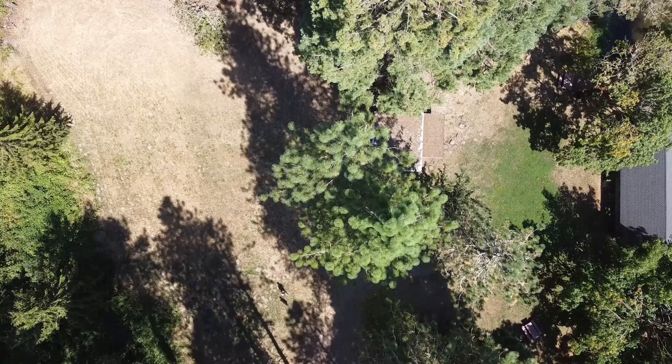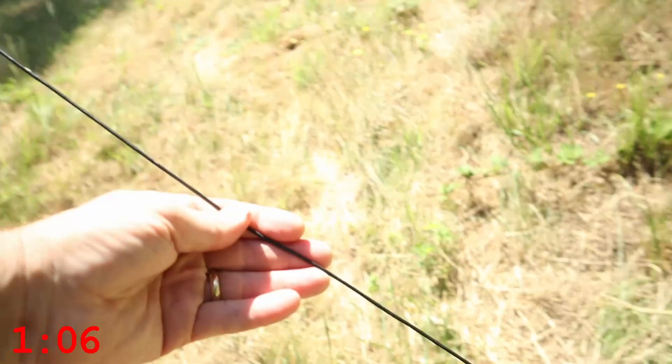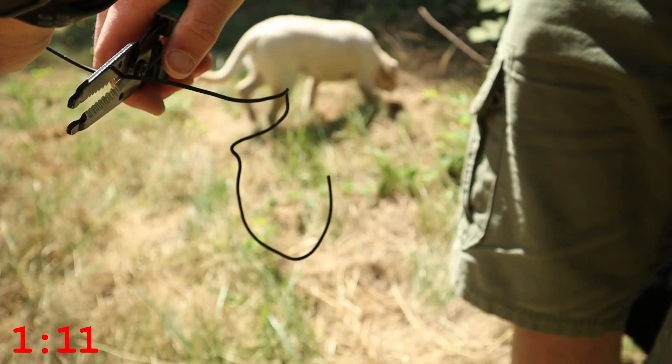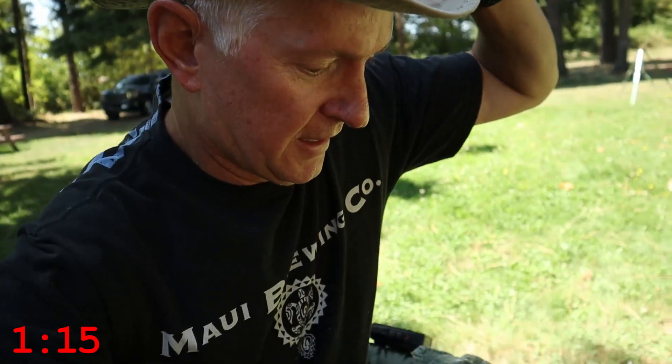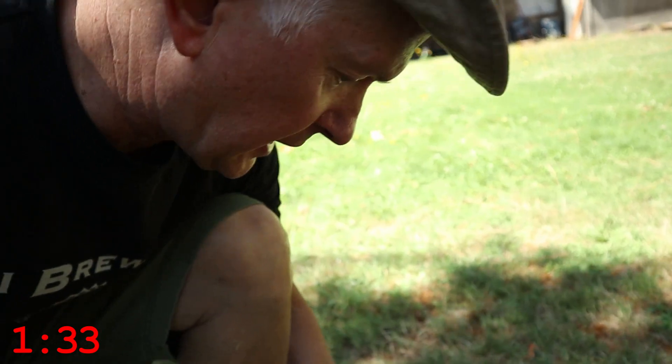Okay, walk over here in the field. Here's our wire. I think we got it. I did make a couple trips to the meter just because I was taking off so much wire, but I think that's normal for a wire you're cutting for a half-wave of 160 meters — proportionately, you're going to be taking off quite a bit. So let's take a look at what we have.